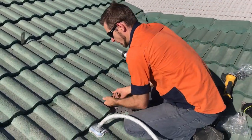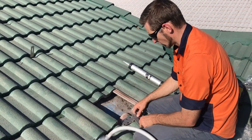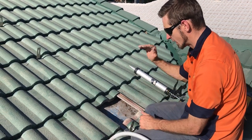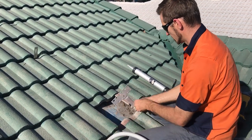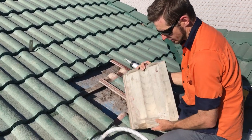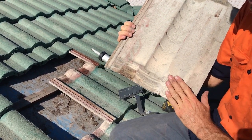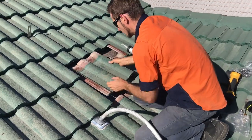To do this we find a truss in the roof — I've got a truss right here, I can see it through the sarking, nice and solid — and we're going to bolt down our bracket right here. But before we bolt it down, we need to make sure the tile isn't going to sit proud of the roof, because we don't want any water getting into the hole. So we pull the tile out, and you can see the large lip — what we do is grind that off. I've already ground that off earlier so this tile bracket can sit flush and won't sit up proud on a big ridge. We just throw that back in place.